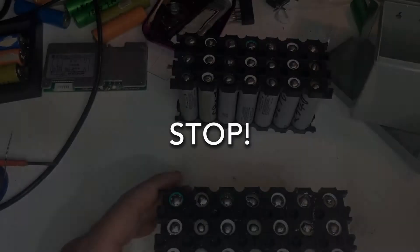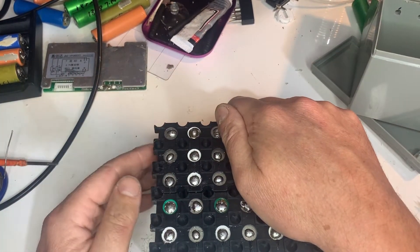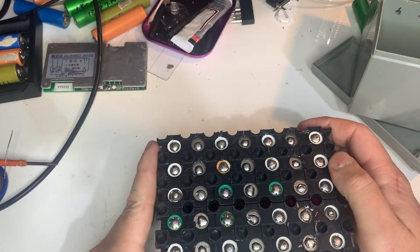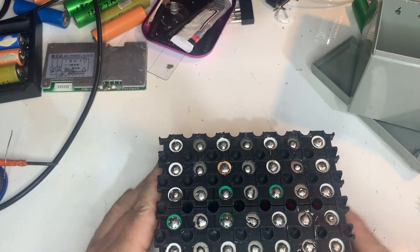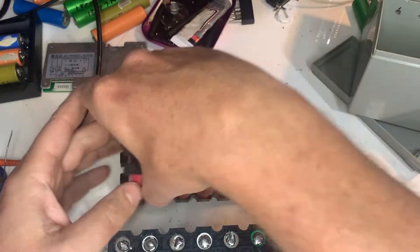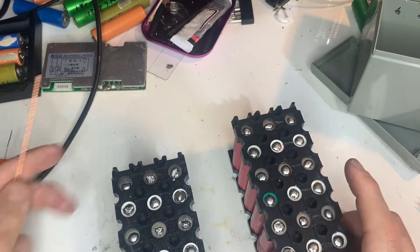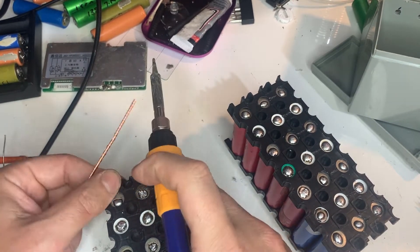I need 7s, not 6s. My DIY power wall is 7s, and I want to be able to charge it from my solar panels. The easiest way to do that is if I make this battery 7s as well — I can just connect it directly from the charge controller. So I took all that off and I'm going to change it to 7s 6p. It'll work out to about 28.7 volts — slightly over voltage for a 24 volt motor, but a much longer range. It can drain down to about 21 volts with no problems. You won't get that out of 6s or lead acid.